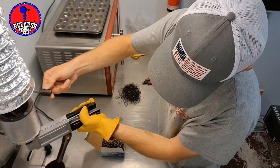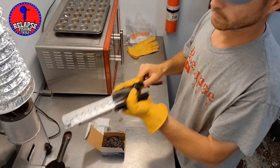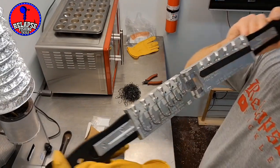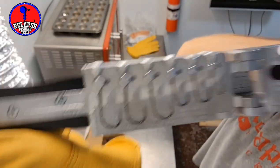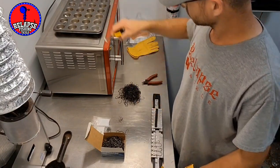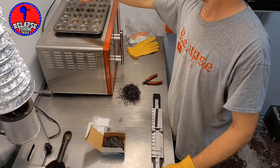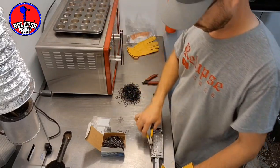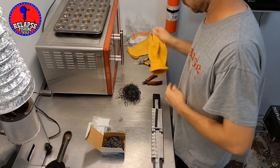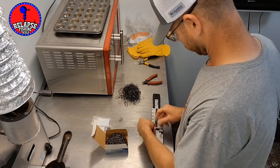Watch out for spills — especially on that last cavity closest to the handles, it's really easy to over-spill and it'll land right in your hand and could burn you like crazy. I apparently have a spider living in my room going across the screen there. Even a thin pair of leather gloves gives you a better chance of not getting injured — you can pull them off quick and hopefully not get burnt. I like using a thin pair for better dexterity.